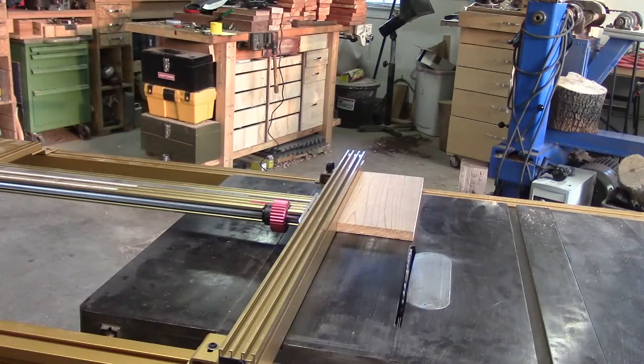For the first cut, I'm going to use the scale on the LS Positioner to make a cut one-eighth of an inch wide. Then I'll come back and adjust the position of the fence with just the incremental positioner to also give myself an eighth-of-an-inch piece once it's been cut, and we'll compare the two — or at least compare the accuracy between both methods. I say about an eighth of an inch because of runout on my table saw and the curve of the blade, so zeroing those two factors, we'll see what we get.